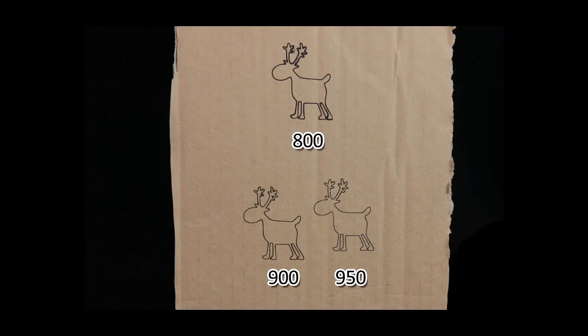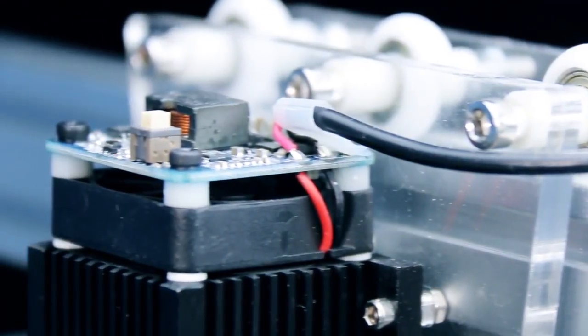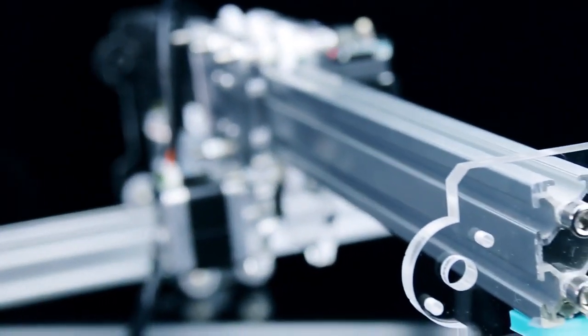Here's another sample on how to check the speed. Lower speed will lead your work to become over-burnt, while you will get a shaky result under higher speed. These results are based on the same time parameter, so if you have a low power engraving machine you should check the time as well. Hope you'll fix your problems with these tips — it's not very difficult but it needs more practice. Feel free to try more and gain some experience.